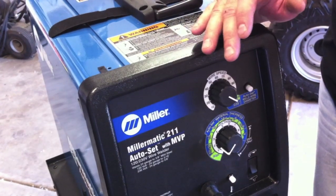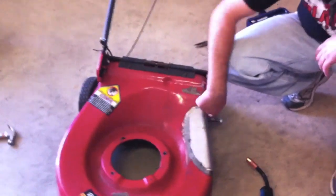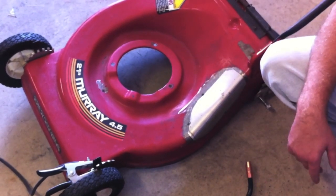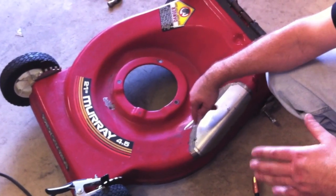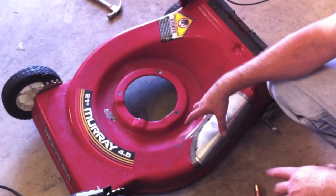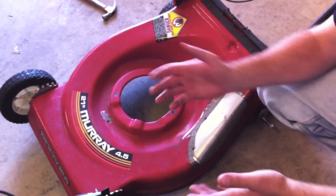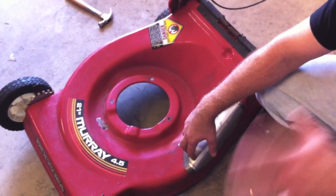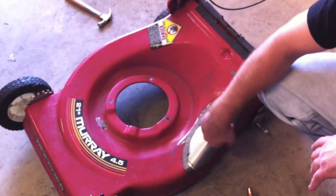So just because you're using 22 gauge doesn't mean you have to set it to 22 gauge — it helps with the speed. That's why I've actually set it to the lowest setting because I'm very slow; I'm going to have to pick up the pace so I don't burn through it. What's nice is you can move the welding material thickness setting around to wherever you want. I do like this welder a lot. What we're going to do right now is shape a piece of metal and weld all the way around this. Best thing I've found is take a piece of this metal and test it on other material to see what speed you can go before you actually weld this. I went ahead and did that already and figured out the speed I'm comfortable with.